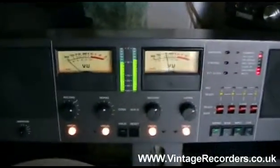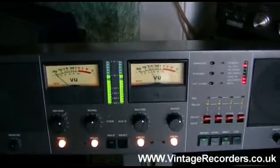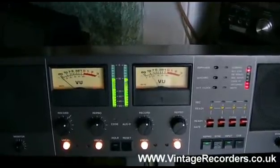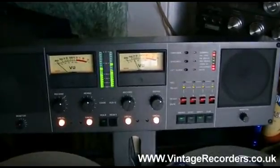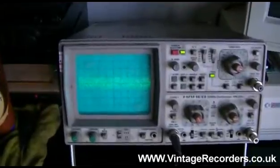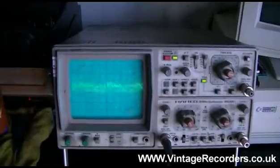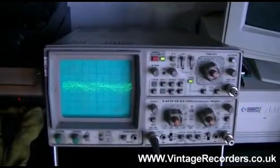I was a little concerned — since the LED lights are powered pre the digital-to-analog converter, I thought maybe the DAC might be burnt out. So I traced back the electronics to the last op amp and found nothing on the left-hand channel, but signal on the right. Then I checked the output of the analog-to-digital converter. On this machine there is only one analog output, which I thought was a bit odd. It's also got a MUX output, and I checked the MUX test — that was fine; it looked like an audio signal.